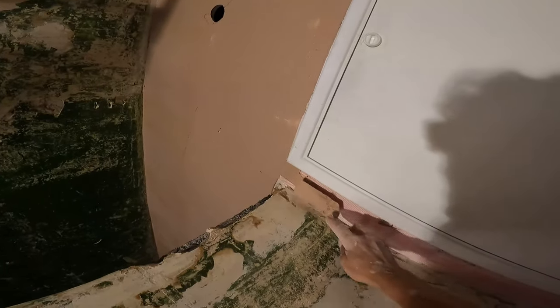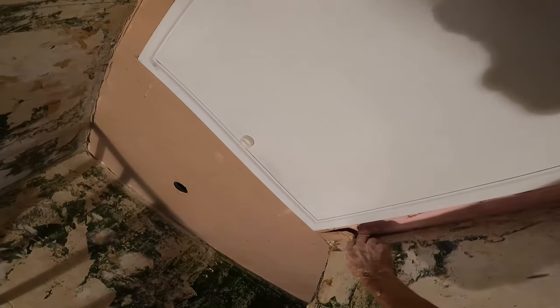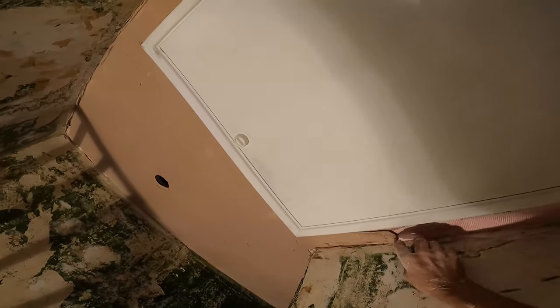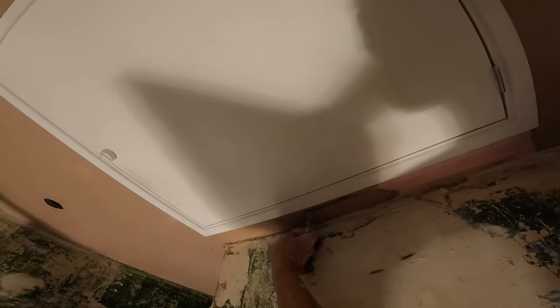Oh, this side I'm having to use, well, it's basically just another smaller trowel, more of a gauging trowel variety. But you find basically you need these for varying sizes to be able to do these awkward bits of plastering, whether it's around something like this or it's around a doorway in a room. It's just handy to have decent ones that don't rust too quickly. If you can get stainless steel, great. Saying that, I think this and my miniature Marshalltown are both carbon.